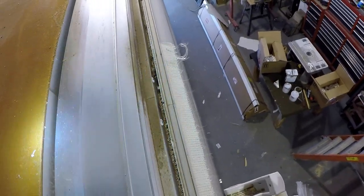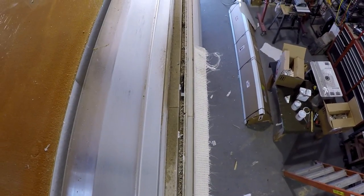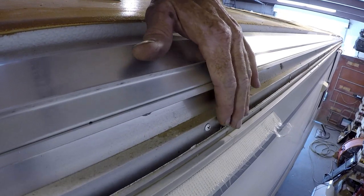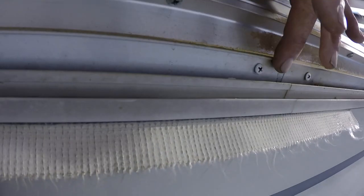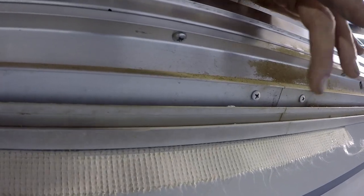So when people are concerned about water getting in the roofs on this roof edge right there, I'm never honestly that concerned about it because it's basically going into a gutter which drains out. I've actually drilled in more weep holes at the front and the rear to help let water out even easier. Just because the design of the roof, it comes over right here, and this is actually below the ceiling line at this point. So it's not very common for water to be able to get here, back up the roof, and into the roof ceiling.